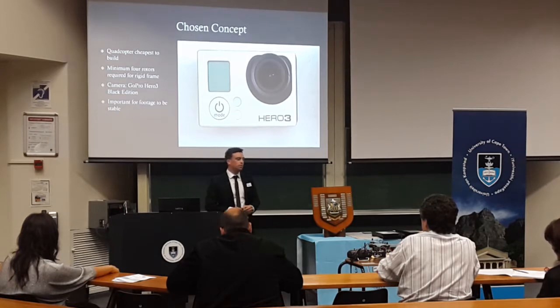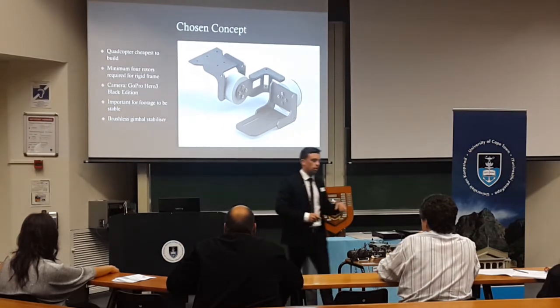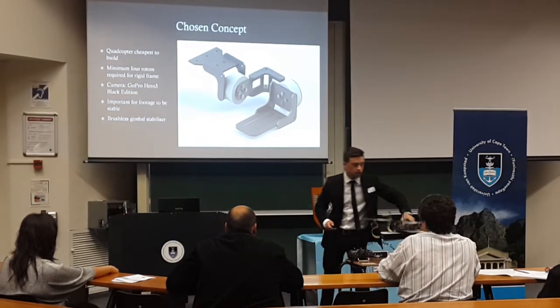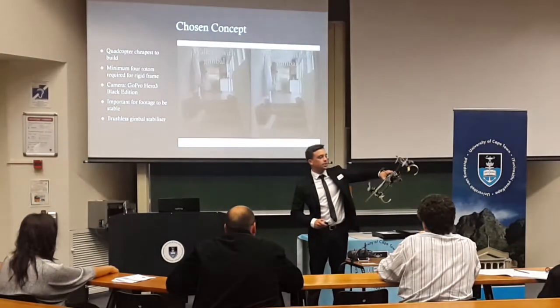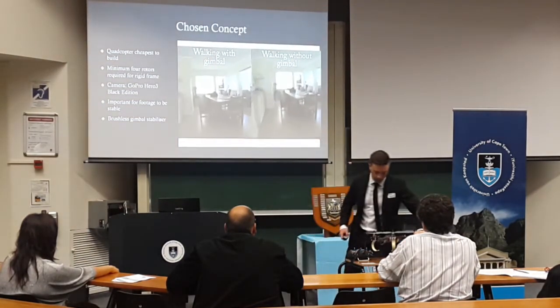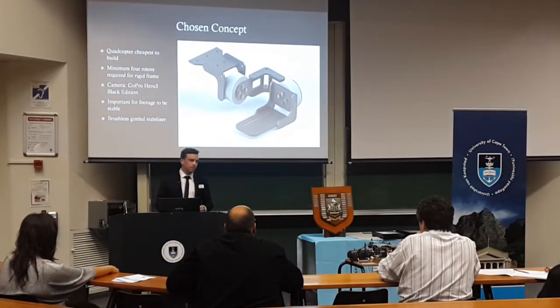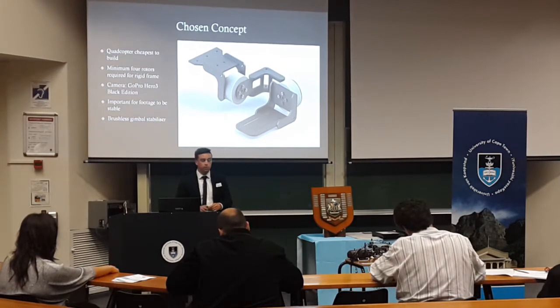In any form of photography or cinematography, it's very important that the footage is stabilized, and the device I have elected to use for this purpose is what's called a brushless gimbal stabilizer. It uses motors on two axes which move independently, and they move to counteract the motion of the aircraft during flight. It is activated now — as I move like this, the camera stays perfectly level during flight. Except for the occasional anomaly. That keeps the footage smooth and fluid in the air.